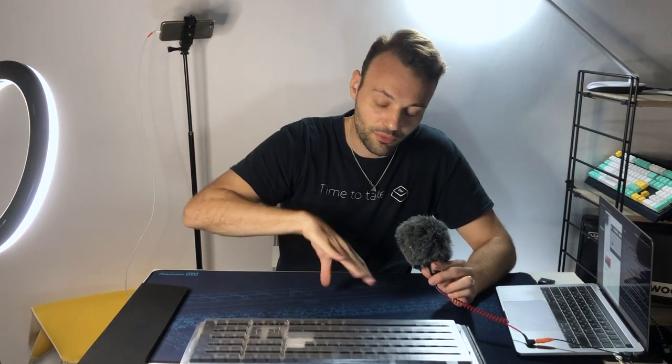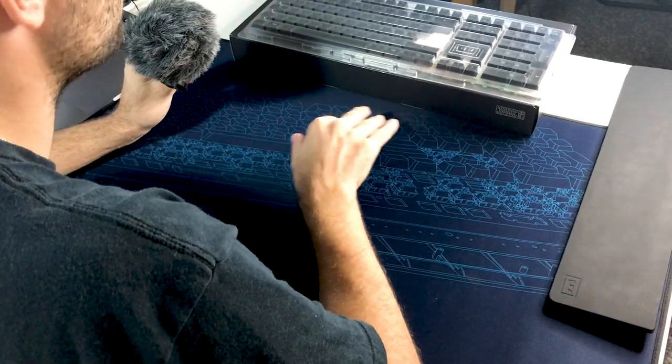And they put it back into its manufacturing process. One of its manufacturing processes is that a magnetic coil is put in proximity of the sensors. I'm oversimplifying this. Depending on the distance of that coil, it will tune or calibrate the sensitivity of these sensors. Now, they'll redo that process and recalibrate the sensors to 4.0, and it will be a defect rate of about 10 to 15% per wafer, which is very low considering the process.